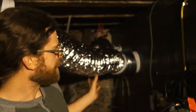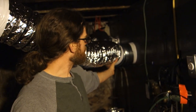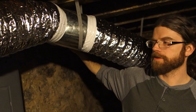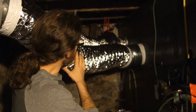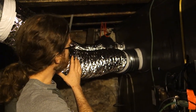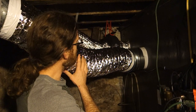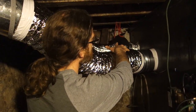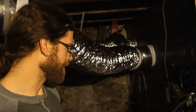This is the outside of the space and this is the 8-inch ducting going in. There's a Y right here — 8-inch to 8-inch and then 6-inch over here. This is our 6-inch over here. I just use regular 3-ply aluminum ducting — it's not going to be moving, so that should do the job. And then a 6-inch fan on a bungee cord. That's about it for the ventilation.